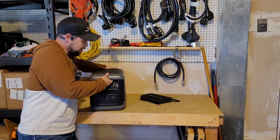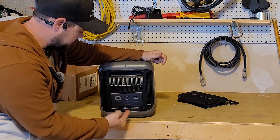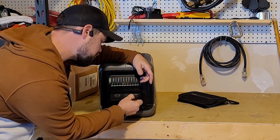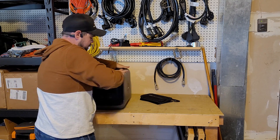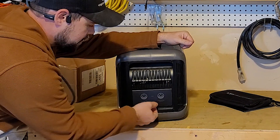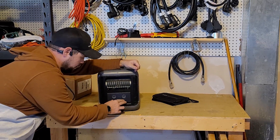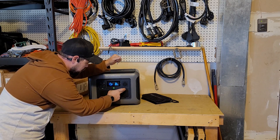There is a really smooth, soft, rubbery grip texture underneath in the handles, and the handles are very deep — surprisingly deep. Pressing here flips up a panel where we have our wall charger input, our AC reset, and an XT60 solar input rated to 12–60 volts and 13 amps. On the back we've got our sticker, serial number, and basic specs. On the other side we have battery expansion ports — you can add up to two expansion batteries using a very common DC touch-safe connector. I don't have an expansion battery here, but I do have experience with those connectors.